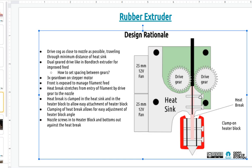So here are bolts that clamp down on the heatsink part, and here are two bolts that clamp down on the heater block. Now, the way Jehad does it, they have a press fit. Here I have clamped bolts. Press fit means you can't really remove it. We like to have it removable. So that's just the concept, and now let's go into CAD, FreeCAD, and see how the geometry actually worked out in practice. That will be the next step.